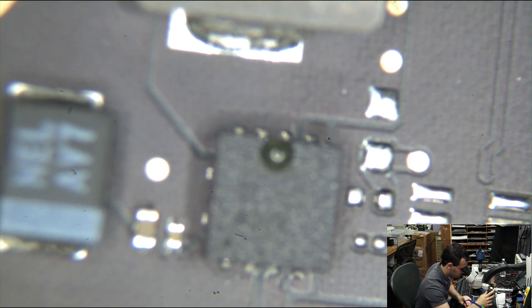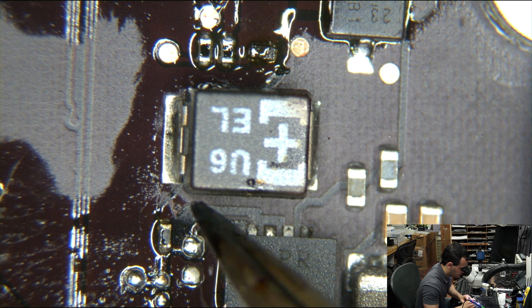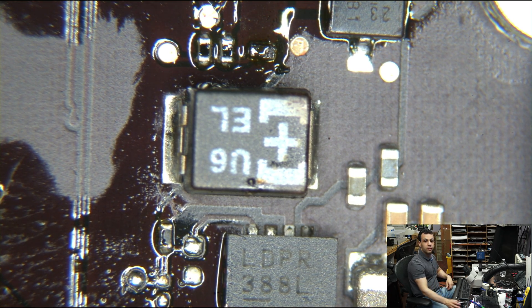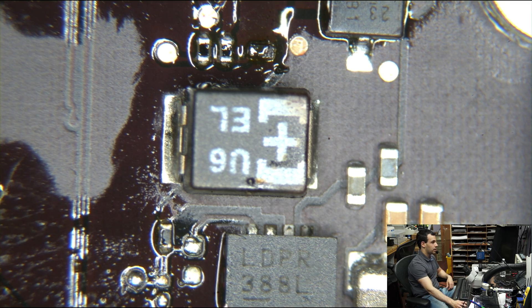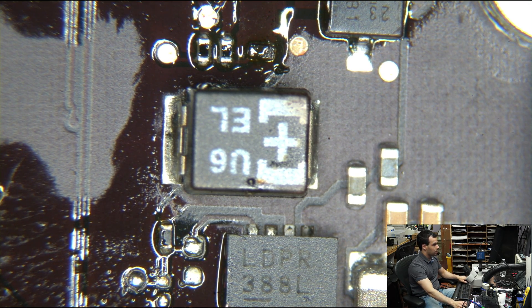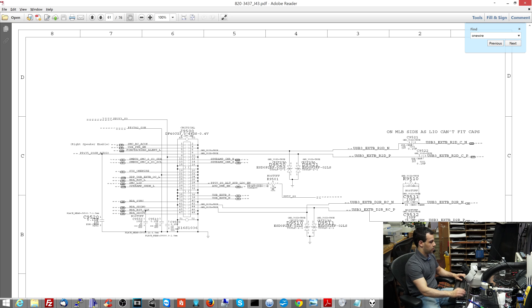Unfortunately I have already fixed it, so you're not going to get to see what the old resistor looked like. Right over here, this resistor had a bunch of brown on the other end, and this is a particularly important one. I've talked before about what the TON pin does on the CPU vCore power rail. If you search for a video called CPU_IMVP_TON, you'll see my talk on that — it's an important pin for power supplies where you have different inputs. Let me open up the schematic here to show you what that does.